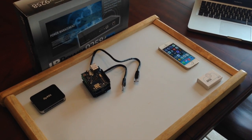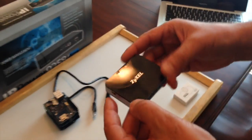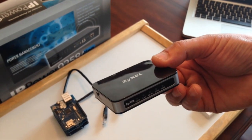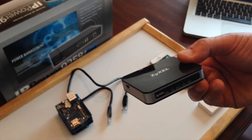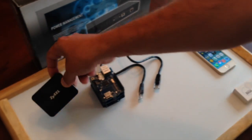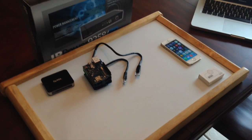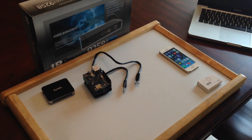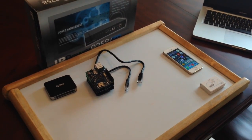To do so, we couldn't use the Wi-Fi because the Wi-Fi system that we have is using this server — this mini router — and it has a range of about 100 to 150 yards. You don't want to automatically lock or unlock your vehicle from that distance. You want to be much closer. So we started using the Bluetooth feature. One of the problems Bluetooth has is range, but it's going to be a blessing for our project — because we want to be right by the vehicle when the door gets locked or unlocked.